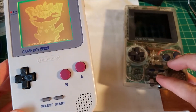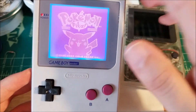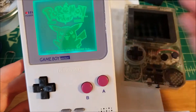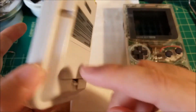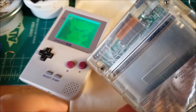I think on this one I used probably 15 or 20 ohms. On this newer guy I used 100, and you can see it's still bright enough to use. It's still fully functional, plenty bright enough. And I'm able to run my chip directly off the built-in 5 volt rail on this guy now — I do not need this extra little DC-DC converter board.